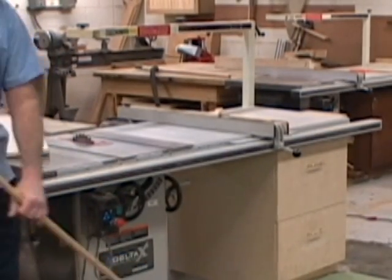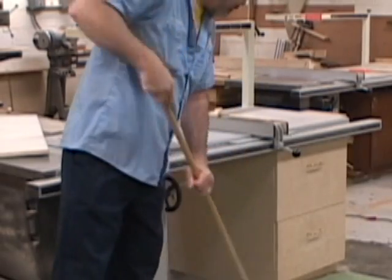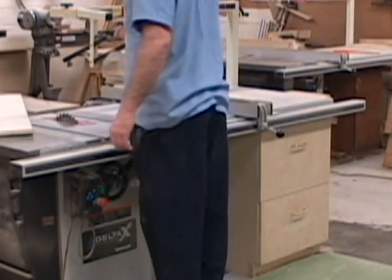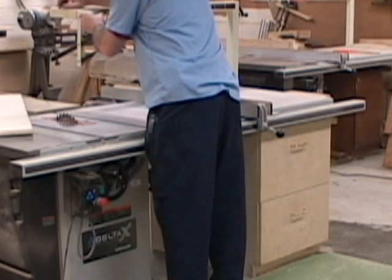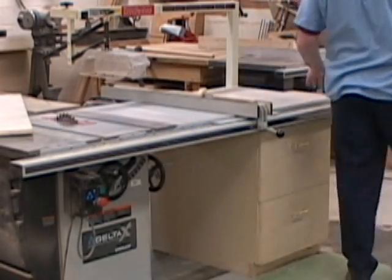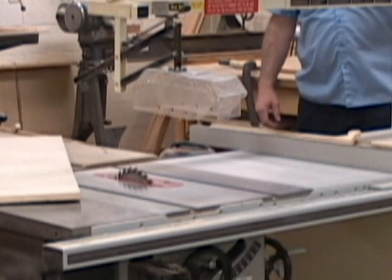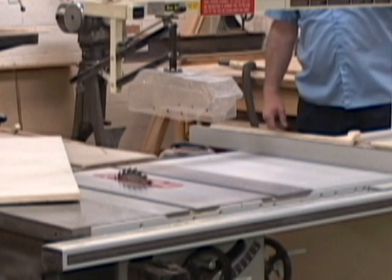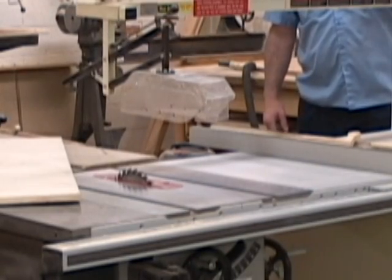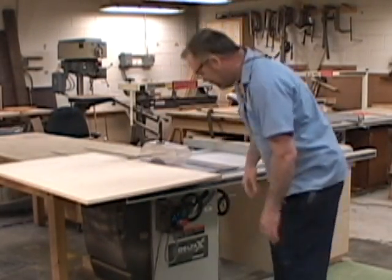Housekeeping and machine guarding are other priorities in conducting any task and preventing injuries. In this example, we see an employee of the woodcrafting division making sure that his saw is free from any debris and that the area around his equipment is free of dust. Removal of these types of tripping hazards will reduce the possibility of slips and subsequently hand injuries that accompany them. This clip is also a good example of guarding one's equipment. Guards should never be tampered with or removed. Standard operating procedures should be referred to when setting up new equipment and the guard that goes with that type of equipment.